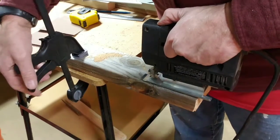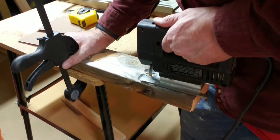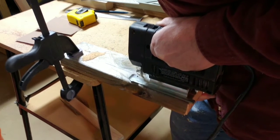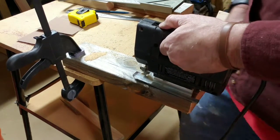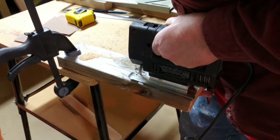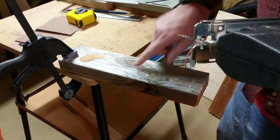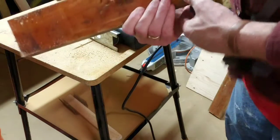You can see my clamp is a little bit loose here because I'm pressing down on it and causing it to do that. So I'll re-tighten it. You hear the saw bogging down? That's me pressing a little too hard. You have to listen for it. This is really tough wood. I think my saw teeth are getting all clogged up. This wood's kind of wet too, which is really making it harder. Wet wood is harder to cut.